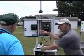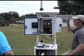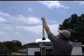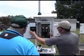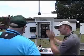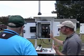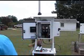It says pass — you don't have to commit that value to memory; it'll tell you if you passed or failed. Enter. Release full vacuum slowly — the critical one is the top valve; release it slowly or you'll blow off the filter. The side one is less critical as there's already some vacuum between the pump and the shutoff valve. Yes to continue with calibration. It will give a warning that leak check should always precede calibration — same warning appears for verification. Our first set point is 10% below target; our target is 22, so we're at 19.8. Next, insert reference flow meter.